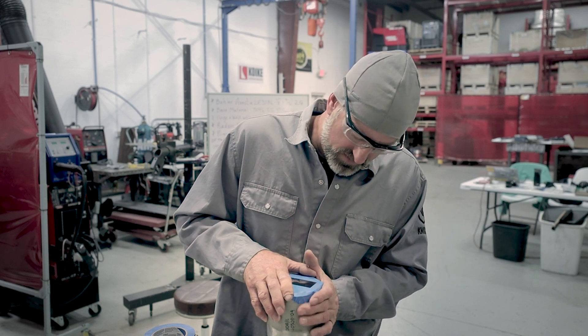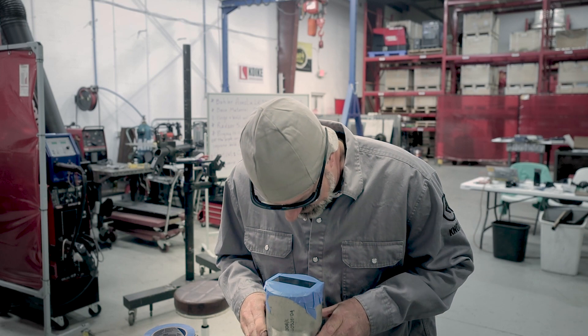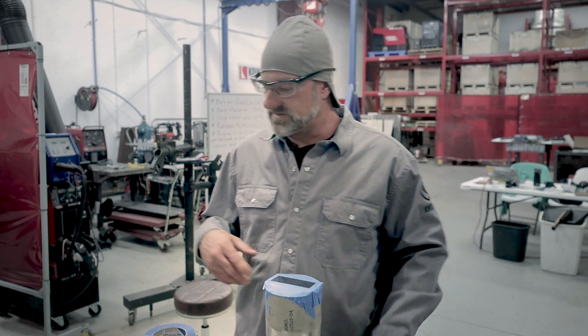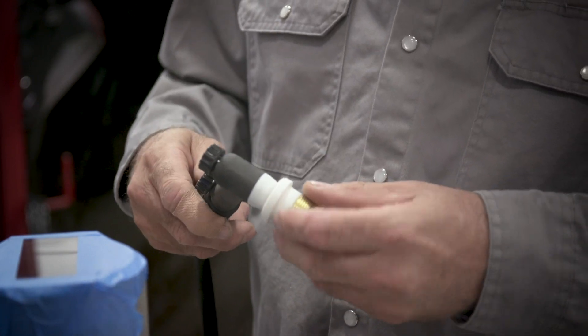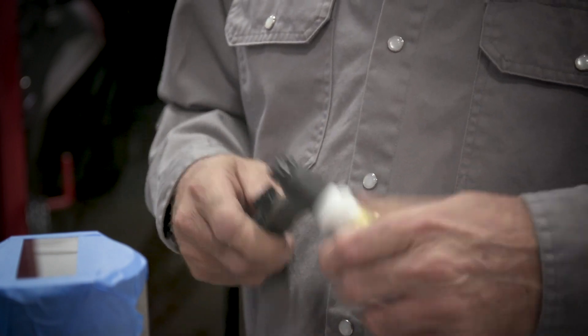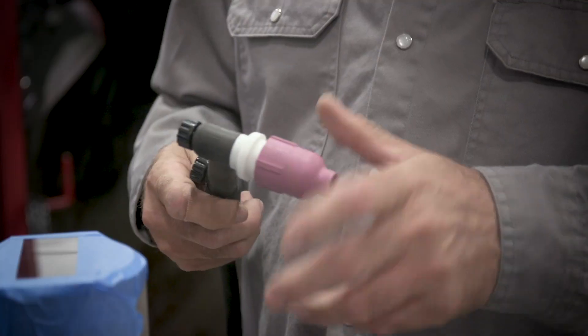That's why I like a window in it - so I can see the fit-up and get my ID exactly right before I tack it. I'm going to talk about the TIG rig. I'm going to use the 17FV TIG torch, and I like using the jumbo lenses because they've got really good coverage on stainless. You need really good coverage on stainless - that's where you get your good color. And of course, the number eight cup that I'll start out with.